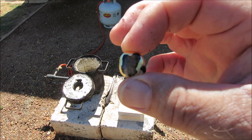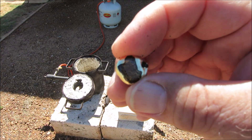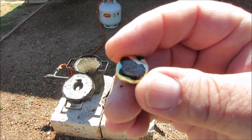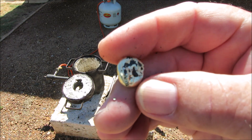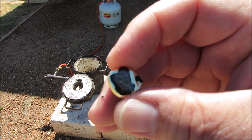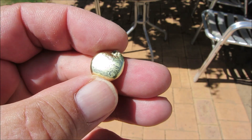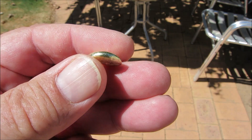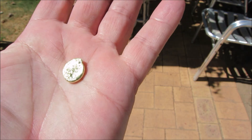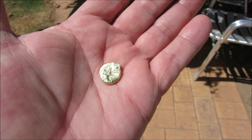It's got a bit of slag on it as you can see — that black stuff. What I'll do now, I'll put it into a beaker with hydrochloric acid and put it on the heat source and boil this gold in hydrochloric acid for about 5 minutes, just to clean all this slag off. I'll be left with a nice clean button. Okay guys, there it is — one gold button. I'll go and weigh it and see what it weighs.